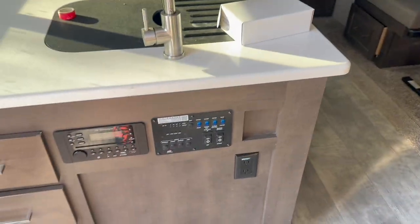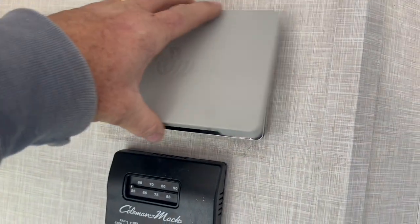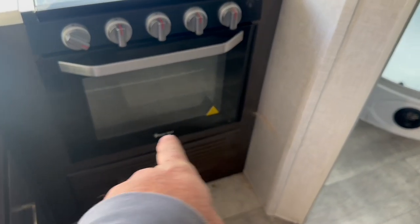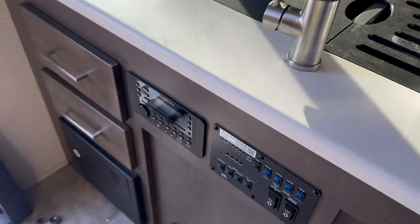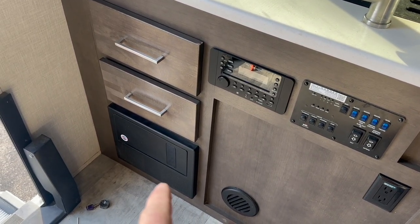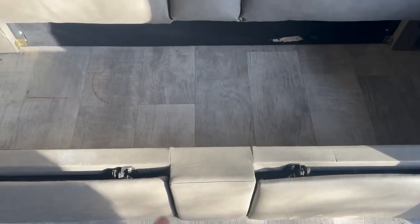So we just looked at the board, now we're back in the trailer. A couple of things we've already done in here: mounted our flat screen display — perfect mount right there. An awesome part of this was that once I took off the vent underneath the stove, there was actually an opening through the bottom of the trailer already there. So we were able to run HDMI and USB cables after attaching them to the flat screen connection. And we got our breaker box for power in and power out — we were able to tap into that, so all those are already run and underneath the trailer.